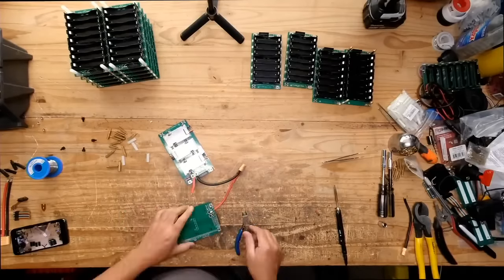I think I'm gonna put a, let's put a purple. Yeah, if the batteries are too far apart from each other in voltage, it's not a good idea, right? But it will start transferring from one to the other. So whichever one has the higher state of charge will start charging the other one. And as long as it doesn't go above the 35 amps or whatever, it should be fine, because both of these batteries can handle quite a bit of power.